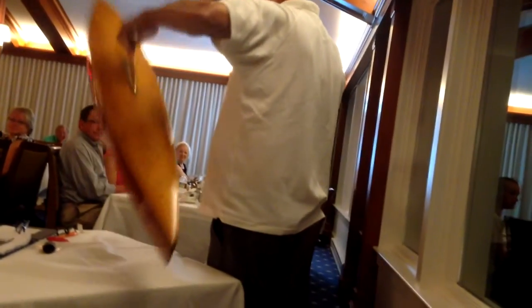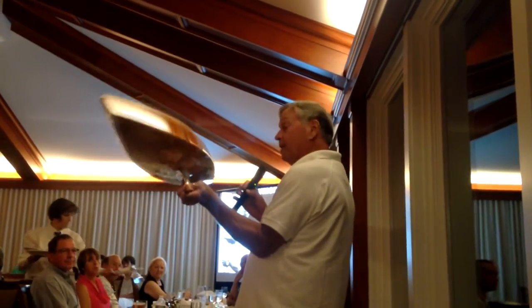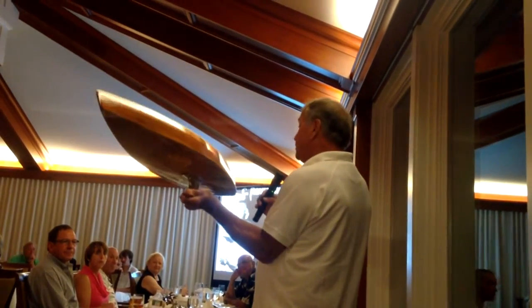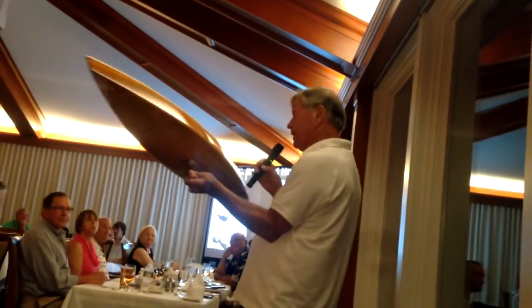A 55-foot 110 would be a pretty cool boat. Talk about being fast. It would have been a rocket ship. But they came back later and said they had made a mistake. The mistake they had made was they didn't take into consideration the chine. It's like a 110: when you heel it over, it develops a lot of lateral resistance. All they had to do was tank the model at about this degree, and the boat was fine. Anyway, I thought that was kind of interesting.